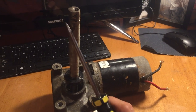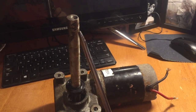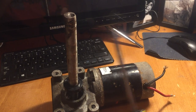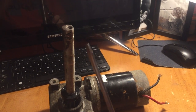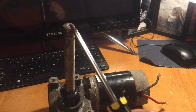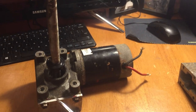Quick tip to get the auger off if you want to save yours — you can see mine's marked up. Drill out your set screw, put a pipe wrench on your auger, put another one down here, and twist them in opposite directions to get it moving. Then I used a ball joint puller. You can see I drilled a small hole here for the points of the puller and pulled it straight off using that. So it can be done.